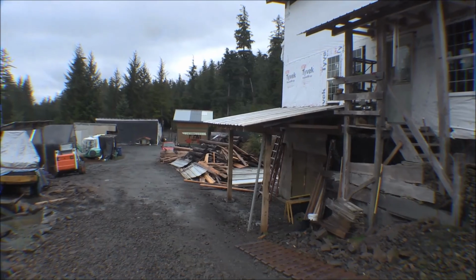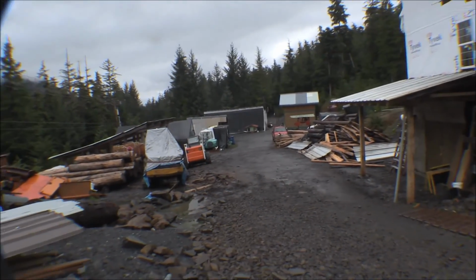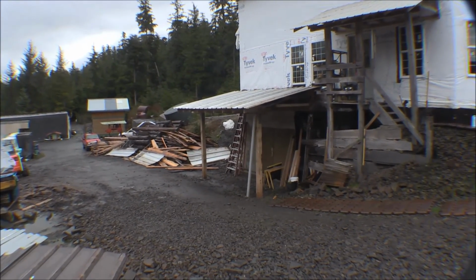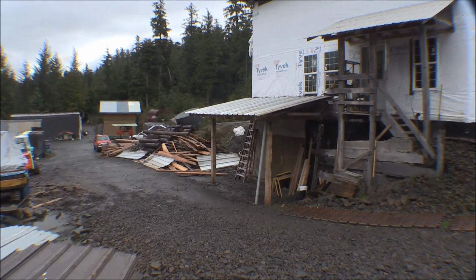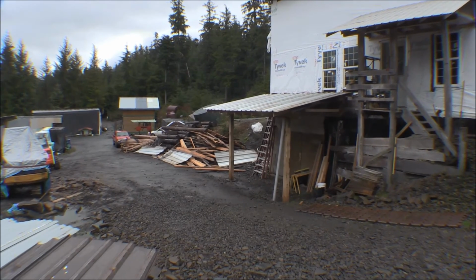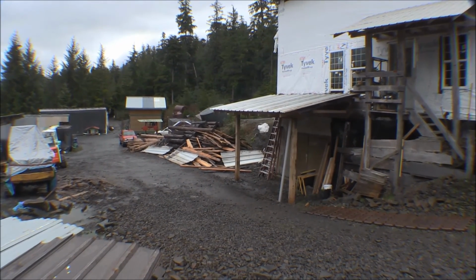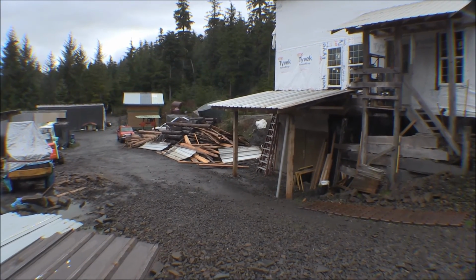Well, the girls dragged down some, got it all cleaned up as best they could, with a pressure washer, and got all the crap off of it. So I cut those panels to 11 feet and 5 inches and stuck them up there yesterday. I put the final piece up just a few minutes ago, and it's some crusty looking old tin. It was salvaged off someplace, or a building that was torn down or something, but anyway, it'll work for what we need there.